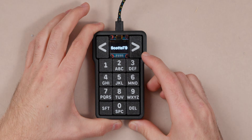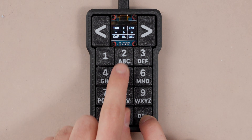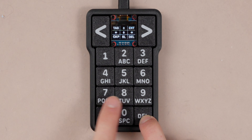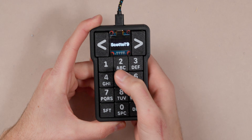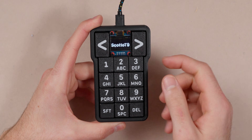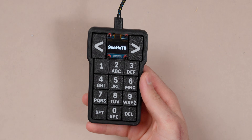What I want to show you is the OLED, because I normally say OLEDs aren't useful — but on this one it actually is. In the bottom right we have our delete key. If you hold that, it activates a secondary function layer. We have tab, up arrow, enter, left, down, right, caps lock, bootloader mode, and forward delete. All the source code is available. As for typing: it's T9 in the non-predictive style. To get C, you tap the 2 key three times. To get E, you tap twice. To get Z, you tap four times. To get numbers, you just hold the key — hold 1 for one, hold 2 for two, and so on. The left and right arrows give quicker text navigation. For a more in-depth look at the key map, I'd recommend checking out my last video on the hand-wired edition.